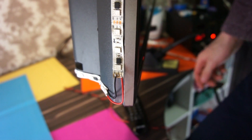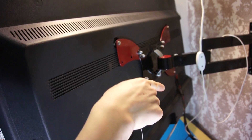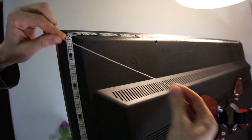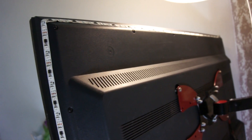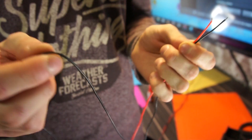That's why I advise you to connect the power at least to three points. I connected a plus and a minus to the beginning of the tape, and a separate power wire to the middle point. Now the strip warms less and shines better. Now we have three wires — power and signal — which connect to the Arduino.